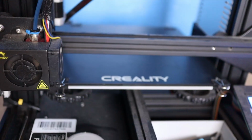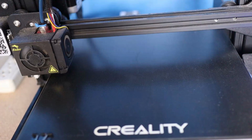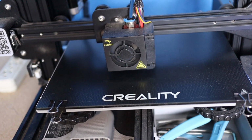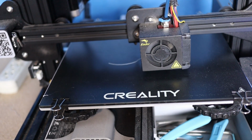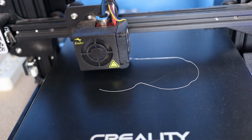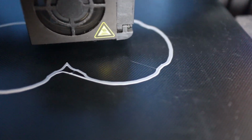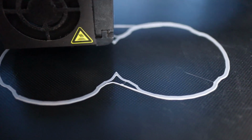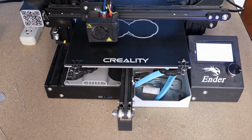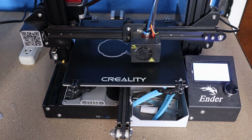Alright, let's start working on the lids. So when I started printing this one originally, I had some issues, and you'll see here in just a second. The first layer started going down, and I realized as it started coming around the back there, it was not adhering to the build plate. It wasn't sticking to it. You can see second pass there, it went in like it was supposed to. So what I did was baby step back 99/1000ths of a millimeter just to drive that nozzle down a little closer to the build plate, and we got it to stick.